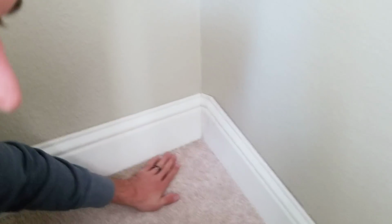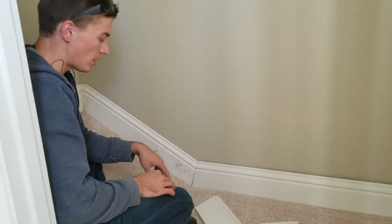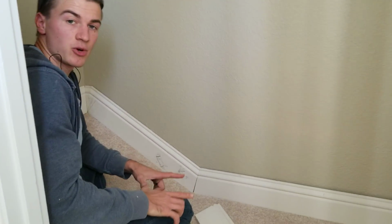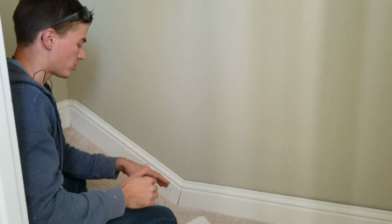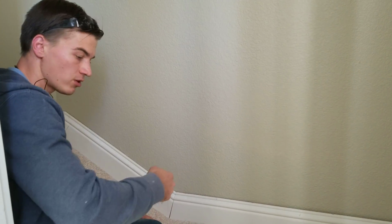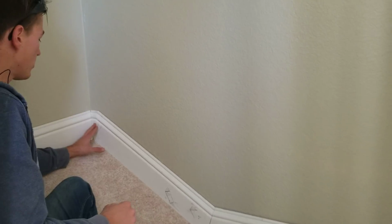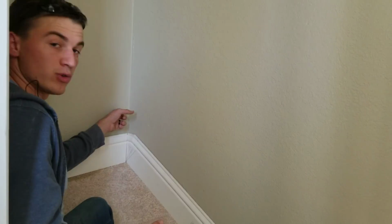Now, to recap, straight line is 180 degrees. Here we had 150. The difference is 30. You split it between the two of them the way that you split a 90-degree corner into 45s when you're doing just regular corners in other places. So you split it, you got 15. You cut them both 15 degrees off from 0. Boom, churn. You come to this angle. You do another churn so that we get to 90.